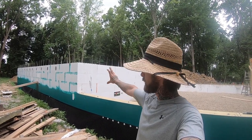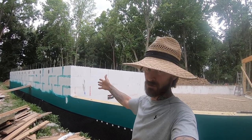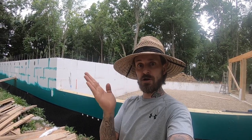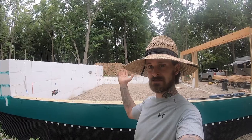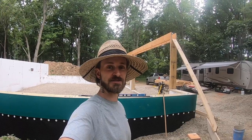Because we're already 30-some inches off the ground and have a 12-foot tall wall to build - building it on the ground, standing it up, and getting it up 30 inches seems like a lot bigger pain. Plus it's pretty much just me on the weekdays building, so there's nothing I can stand up. I may have to put the first two-by-twelve against the basement wall here as my stationary support - that's four feet of ICF I can screw into - and then run the next one over with blocking in between so they're not going to want to fall. Pretty happy about this so far - those things are 95 pounds a piece and that was not easy.